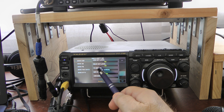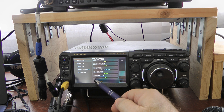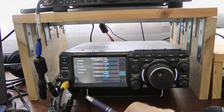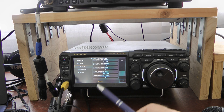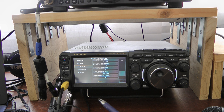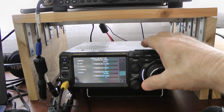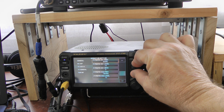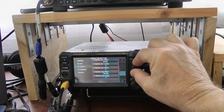I'm going to go into Radio Settings. You'll notice my transmit bandwidth is opened up at 50 to 3,050 hertz. Then I'm going to go into Operation Settings. You will notice with regards to the parametric equalizer — when you see P in front of the parametric equalizer, the P denotes the settings for when you have your processor turned on. I have P parametric equalizer one frequency at 300, with the EQ level at minus 3 and the bandwidth at 0.